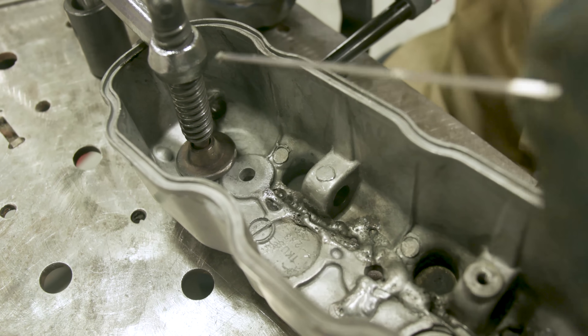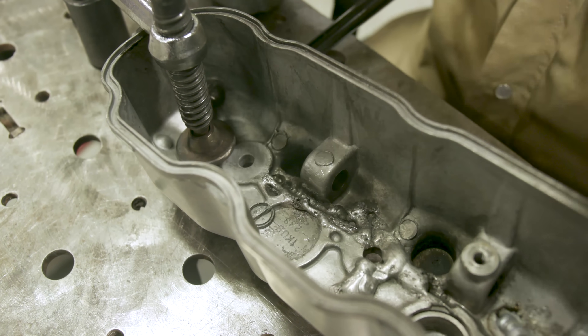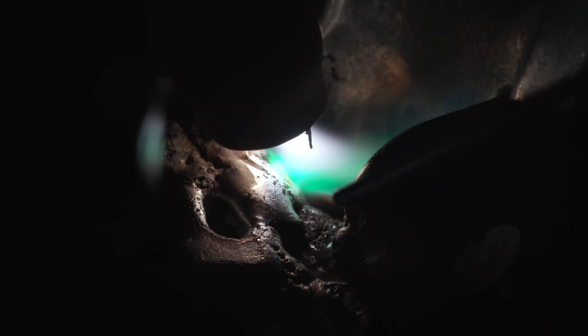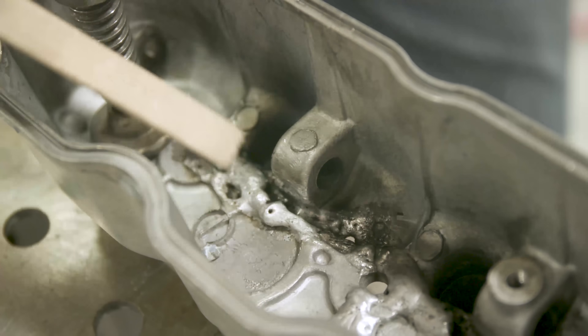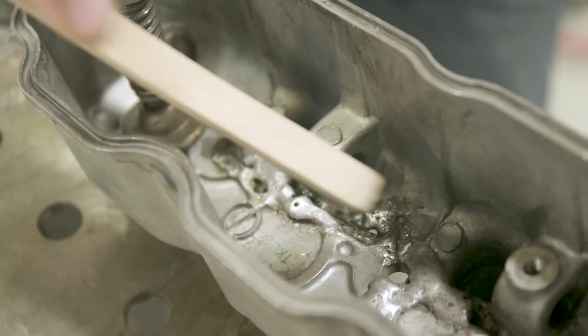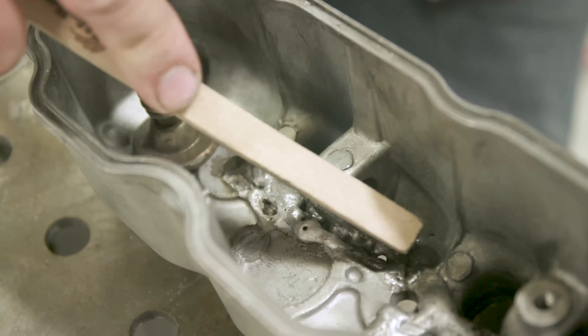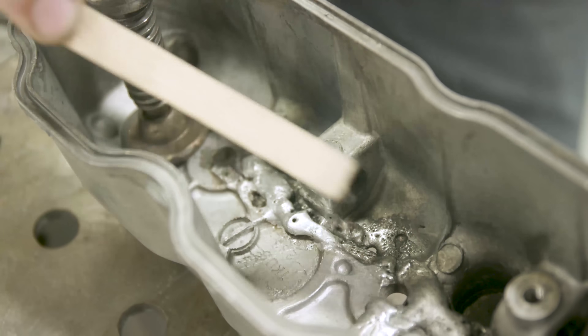We're going to start right here on the clean metal where there's no crack, get some good metal started, and then just go over this crack and start welding — because once you get good clean metal, it gets a lot easier. It's got oil in it, so it's not one of these things where you make it look pretty; you're just trying to seal it up. It had diesel oil in it for 40 years, so just got to keep working. We're going to shape the ugliness out with a grinder carbide bit — that's just how old cast aluminum is.